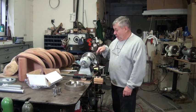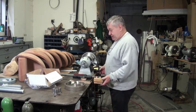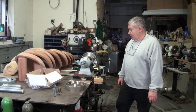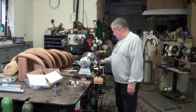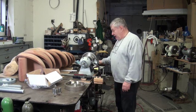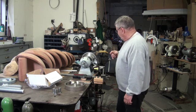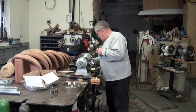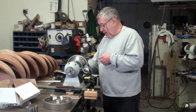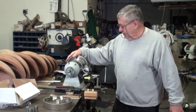I'll click this one on here — I've already installed the 180 on this side. Now that's slow speed right there. This grinder is just sitting here. You can see it runs pretty smooth. That's high speed there — you can see that runs pretty smooth too. If you want to slow these down, you can take one of these belt cleaner sticks and slow it down. They will run for quite a while. You can also take a rag or a leather glove, hold it on the inside, and it will slow it down.